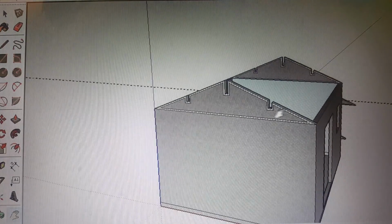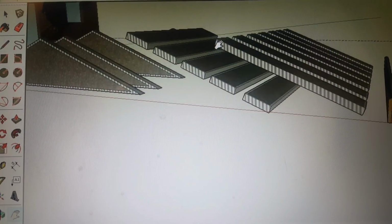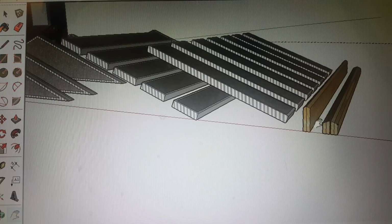And that being said, let me pull this over, and we'll look at a panel that's sitting horizontally. On this panel sitting horizontally, I put bricks under both sides, 7.5 feet apart, and I loaded it with almost 500 pounds right in the center. Because we have the fabric mesh and the reinforcement just along the bottom side of that panel, that changes the fulcrum point to where that mesh is. When I put that 480 pounds on it, there was about a 1/2 inch deflection, where this panel bowed and flexed about a 1/2 inch.